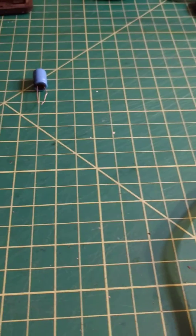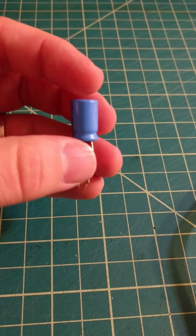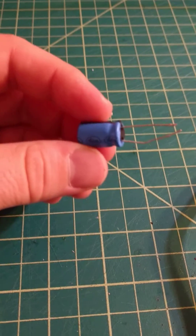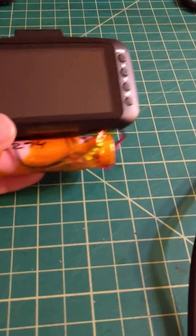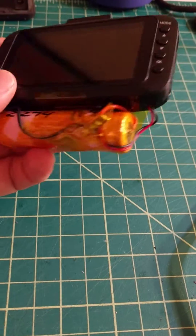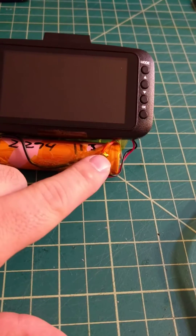Normally the lowest this cell should ever get is about two and a half, maybe three volts — so this is completely dead. I thought maybe I could use a capacitor, but it does not have nearly enough charge to run it for about five seconds while it shuts down.